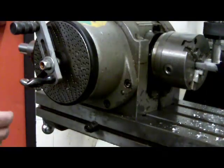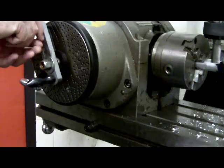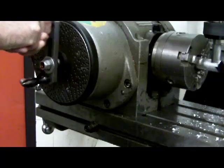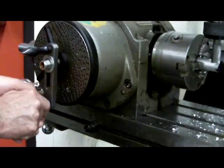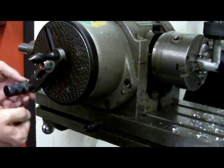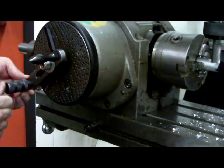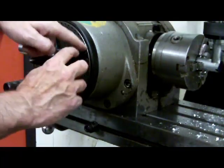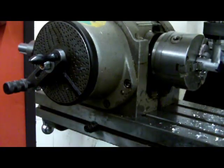I don't need to turn the milling machine off because my hands are nowhere near the spindle — I'll be out here on the hole plate. Again, I pull that pin out, five complete revolutions: one, two, three, four, five. Then five-sevenths of a turn, or thirty-five spaces on a forty-nine hole plate. Drop the crank pin on the plate and tap it until it pops into the hole, going clockwise. Take the sector arm that the pin was on and push it around until it is on the pin again. We're ready to cut that second flat.